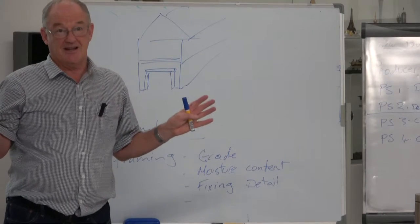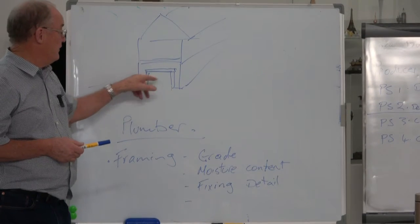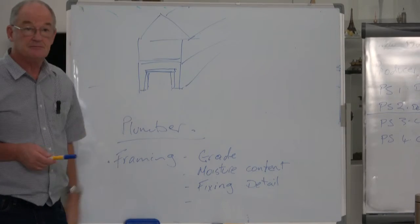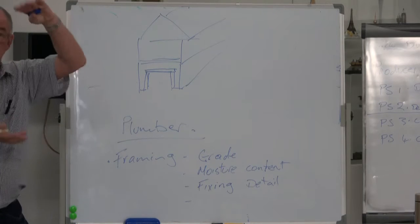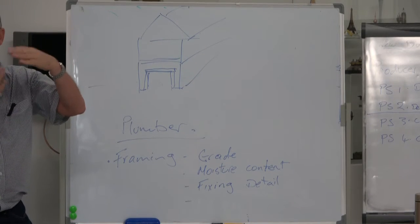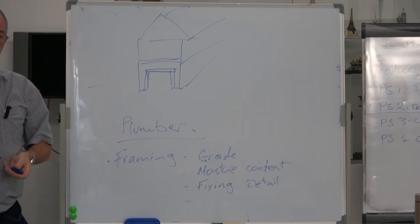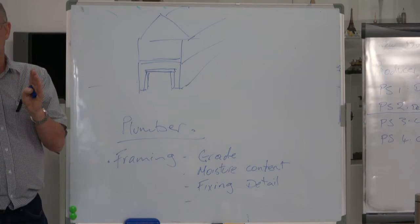So there's a bit of a problem. What's the way around it? Then I would be removing the gib board on the inside, particularly around that area, and removing a patch of gib board to see the connection between the post and beam. Was it a timber beam or a steel beam? Timber, so a double or a triple lintel.